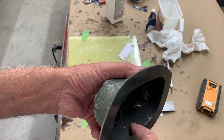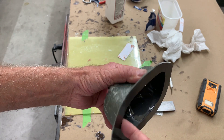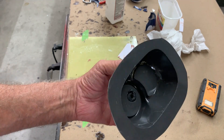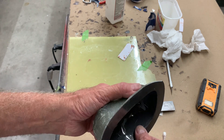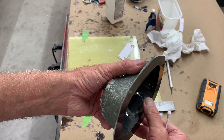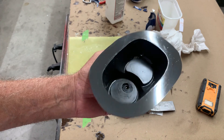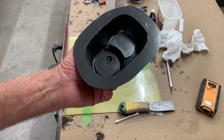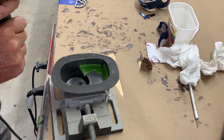The other issue is the manufacturer didn't cut around the perimeter very well and I couldn't risk going over it. What I'm thinking of doing is lightly sanding all around this outer edge and maybe putting some filler so it's nice and smooth — that will give a really nice flat base to go onto the actual plane. Then we'll try and polish up the mold; I can feel about a half millimeter ridge that's going to lock up the part. I can use my endoscope to get a good look at that.